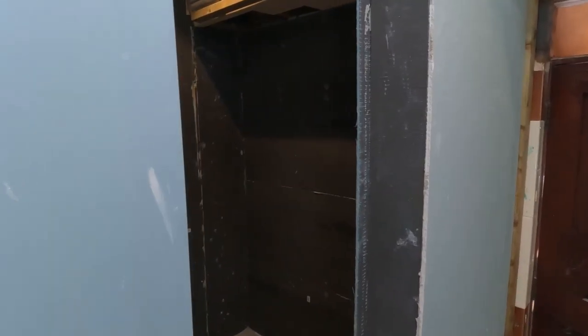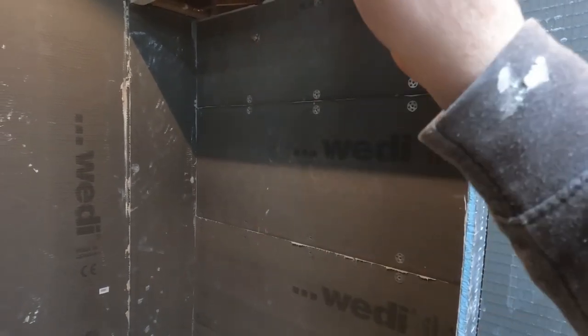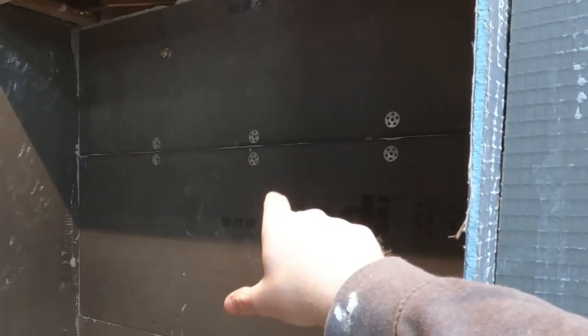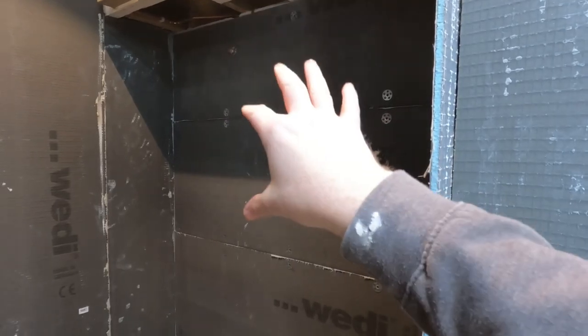So this is one of the shower blocks that we're doing. We've just laid all the Wedi board onto the walls. So this is a stud wall with a clear DPM and insulation inside that's been screwed up. We have the stainless screws with washers. We just got to finish off another one in the middle. We just tacked up for a minute.